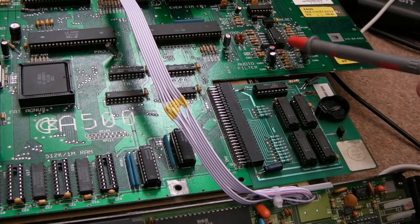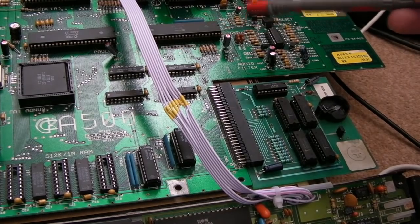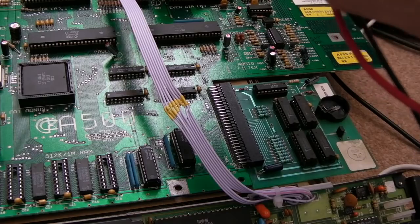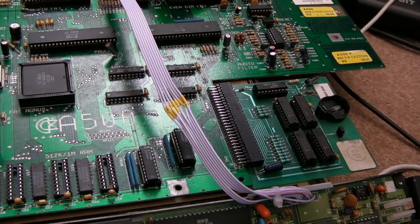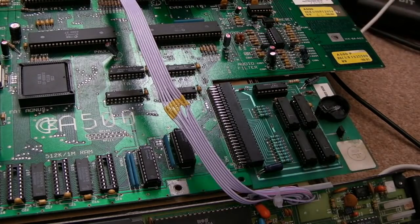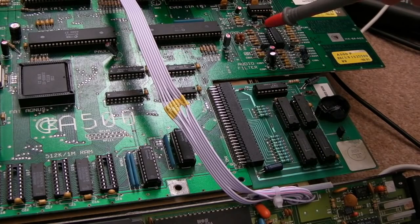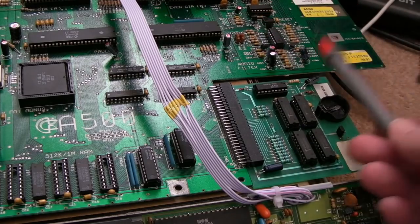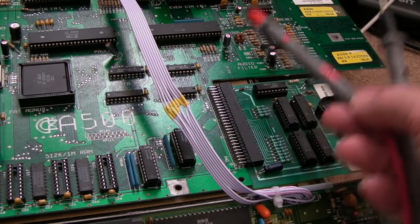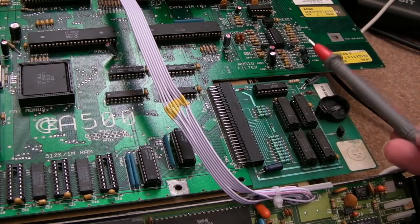The op amp was previously socketed up by me — I didn't cover that. As part of the A590 stuff, when I did the filter fix, while I was waiting for the 1488 I removed the filter components at the back — like these here, a capacitor and inductor in a single package. I removed those to do with the 12 volt and minus 12 volt, removed the transistors, the filter transistor, the op amp, measured each of these components, removed the caps and measured those — because we were getting really crazy issues and I was trying to rule out something going on with the plus 12 or minus 12 in relation to the audio. Anyway, long story short, here we are now where when this warms up it starts to glitch out.